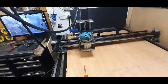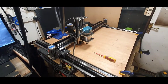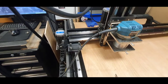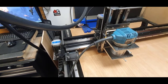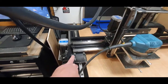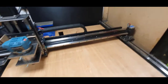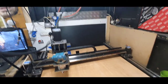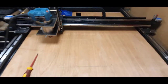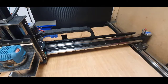Obviously if you're engraving you've got to be careful because this is metal engraving too, so it's got to be flat. If it's not flat it'll be deep on one side and not the other - that's the tramming. When I built this CNC it trams absolutely bang on - it cuts within 0.01mm. With the wood, because on the plasma you've got the kerf to worry about, I've got adjustable screws to lift each end up. If I'm engraving I'll put a routing bit in just to flatten/mill the area, and once I mill it I know it's level.